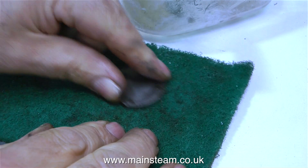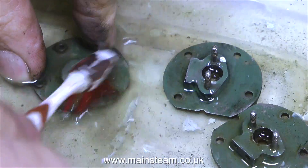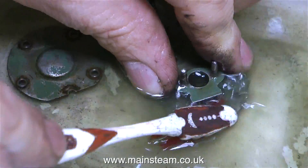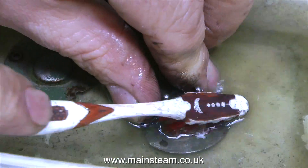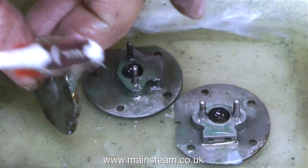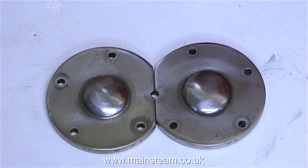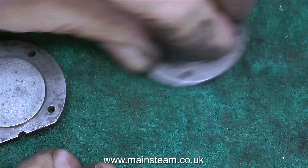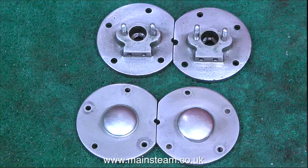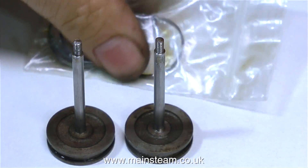After polishing one of the parts on the polishing spindle, it looks much better. Once I knew it was going to work with the first part, I carried on with the rest. The longer I left the parts in the cellulose thinners, the easier it was to remove the paint. Health and safety warning: always use cellulose thinners or any other strong solvent in a very well ventilated area. After polishing the top cylinder covers, they look good but a little too shiny, so I used some Scotch Brite to get rid of the shine — if you look at photographs of full-sized steam engines on the internet, you'll see what I mean.